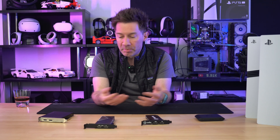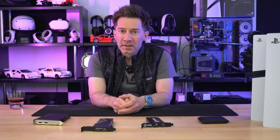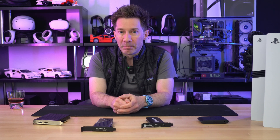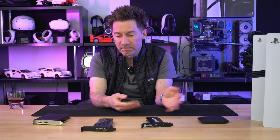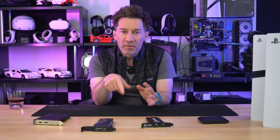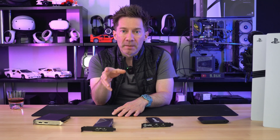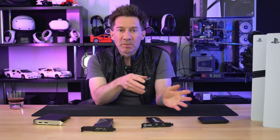But I did just say these two cards are 60Hz cards — HDMI 2.0. Give them a 4K 120Hz signal and they'll just give you back a blank screen. So if I wanted to record my 120Hz GT7 gameplay, forget about it. I'd be racing at 120Hz, then back out to the menu, switch to 60Hz mode, hit a random button on an HDMI switch, switch inputs on my TV — moving my whole setup over to the capture card to capture the old-school 60Hz signal. What I needed was an HDMI 2.1 capture card.